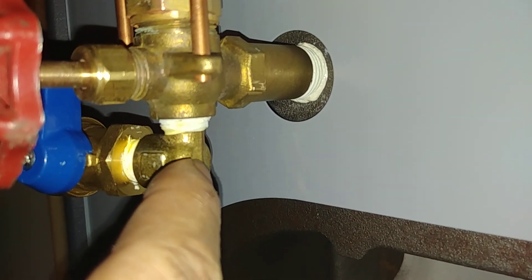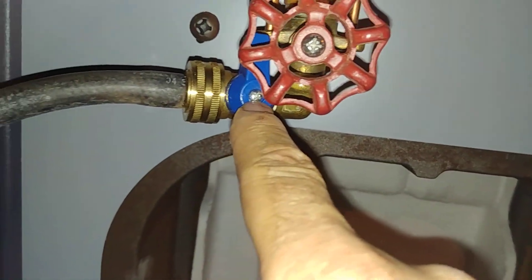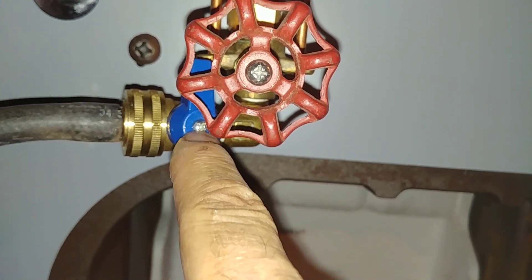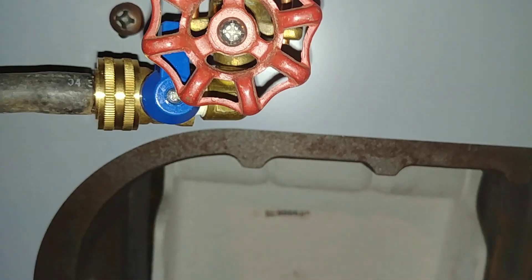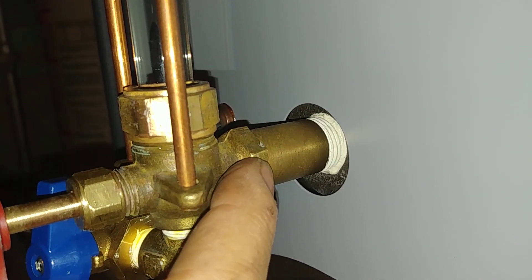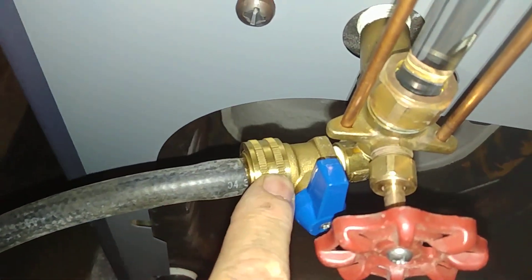In order to clear the door we've got a street quarter-inch brass 90, and then this is our blow down. To put this blow down in, it's probably best in this situation to remove this screw. My advice would be to get a number one JIS — Japan International Standard — screw, because this is coming out of Taiwan and that'll make that screw come off a lot easier. These are rescued parts that have been treated with citric acid to clean them up.